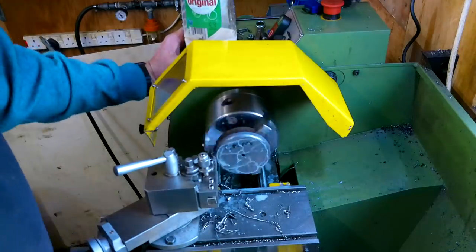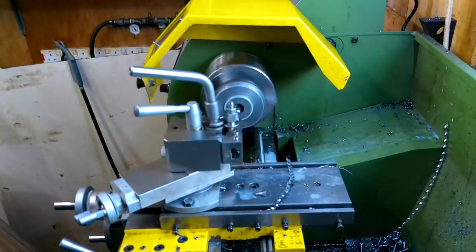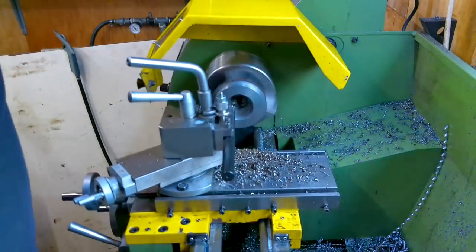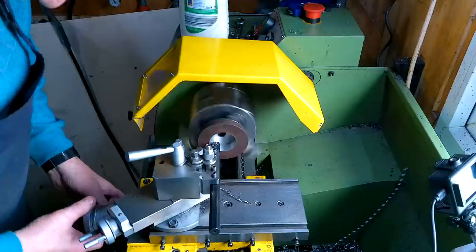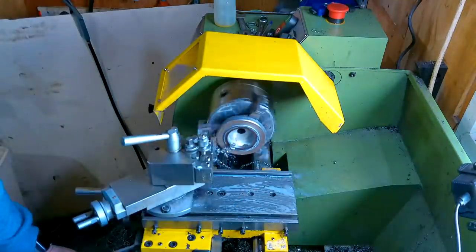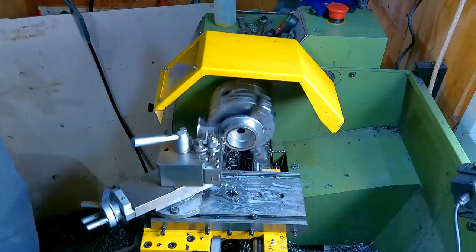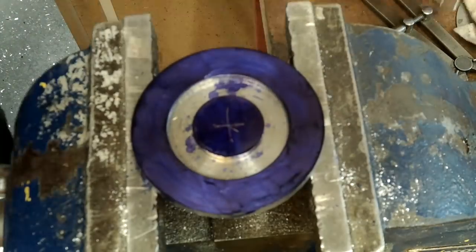This part is going to be the cam. This cam is supposed to provide continuous vertical action to the advance tube, and this vertical action is the key to cutting the relief angle on the drill bit. Behind the cam is a loose spacer washer, preventing the cam from being pushed back into the jaws while I rough it out. You can see there is quite a bit of material to be removed. This is the same cam but in its pre-finished state.